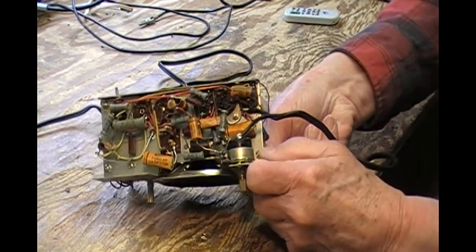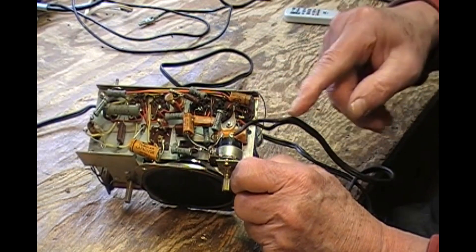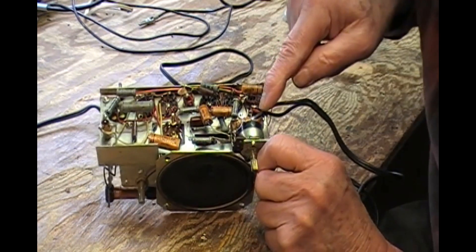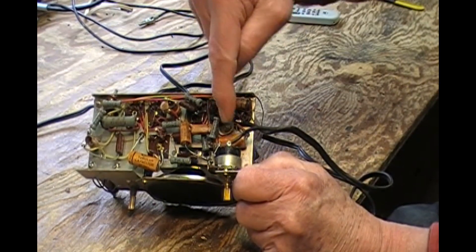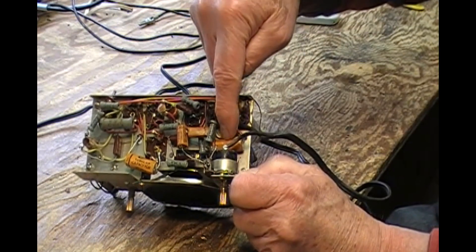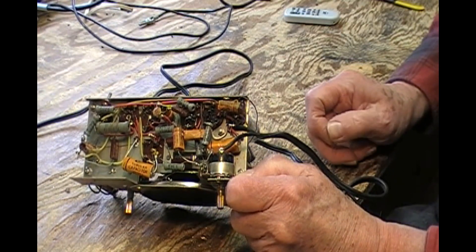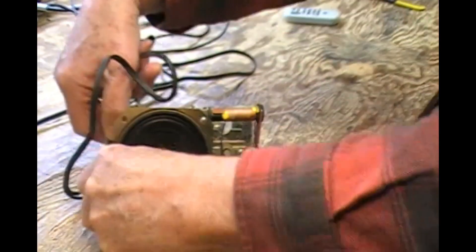The cord was cut off, so what I've done is solder in temporarily a replacement cord. There are five capacitors, including what I believe is what they call the death capacitor — this connection from live to the chassis. Of course, if that capacitor fails and shorts, anybody touching the chassis could get a nasty, if not lethal, shock. So let's give this a go.